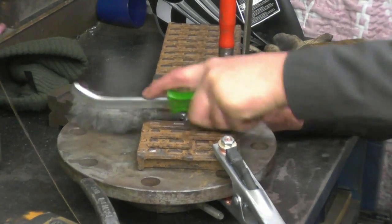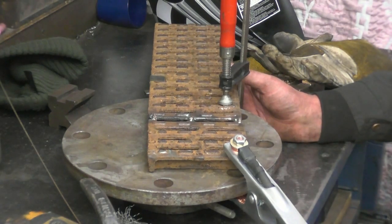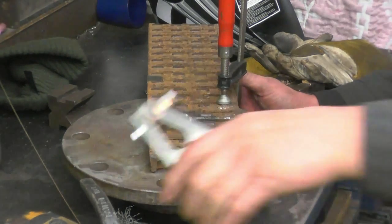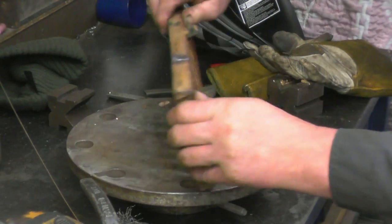I'm actually welding this with an AC current. I've used the AC cleaning action and it did a good job of cleaning the cast iron. I've used AC before and it runs on and it's almost quite itchy. But they are certainly stuck together.